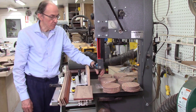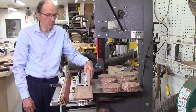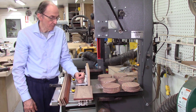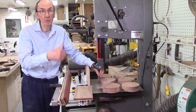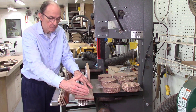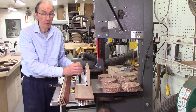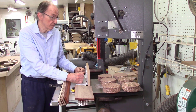It's amazing when a blade is brand new — when you make the first cut, it just breezes through the board with no resistance. As the blade gets dull, it takes a lot more push to get through. Also keep in mind that the slower you cut, the smoother the cut, allowing the bandsaw blade more time to go through the wood and actually act like a planer. I run my boards through my bandsaw very, very slowly. The slower you go, the better the finish is going to be.